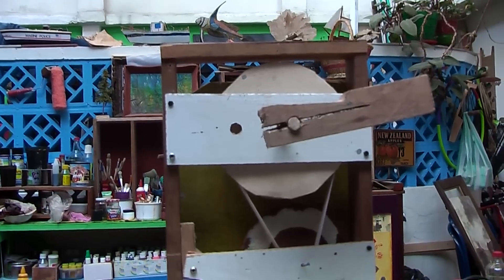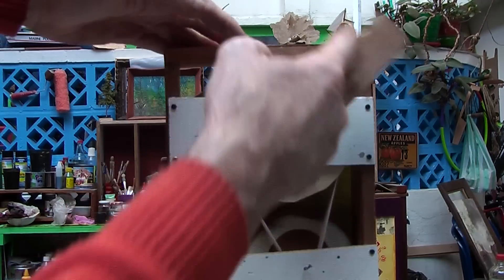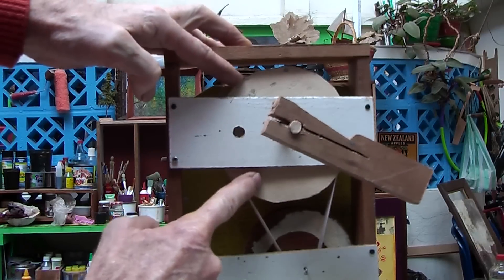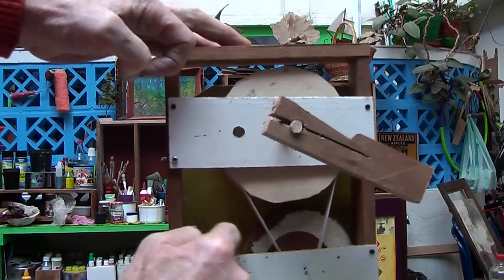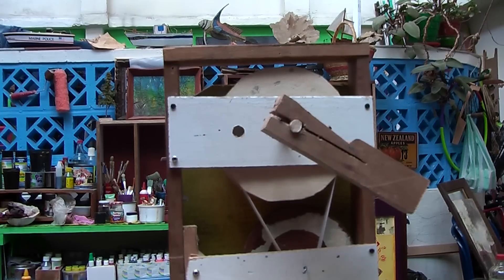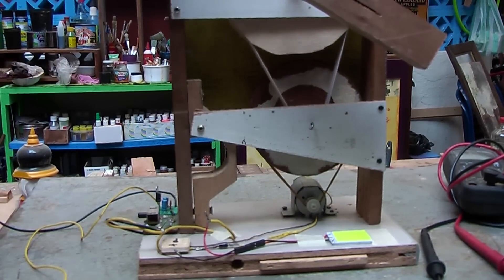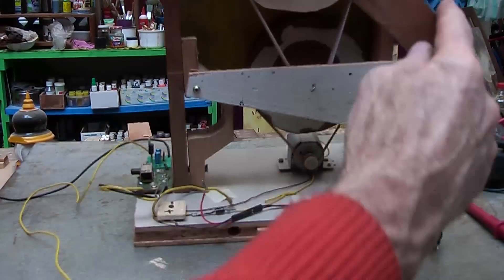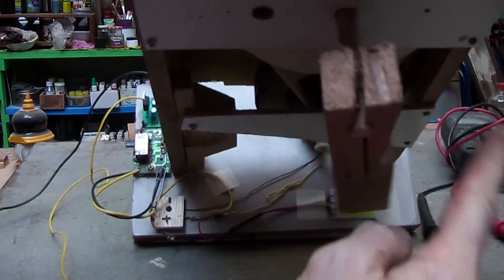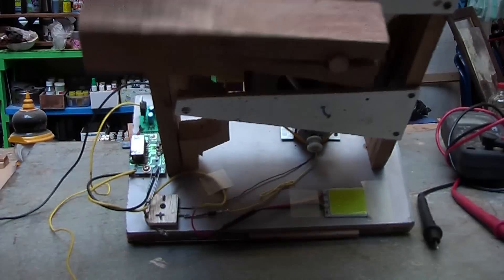Having proven the point, I decided to go a little bit simpler. Instead of using cogs, I just used pulleys — going from a first wooden pulley with cardboard sides, to a brass strap, to a wooden pulley, down to a motor scavenged from a printer. That generates 12 volts at 40 milliamps, which is enough to run a motorbike headlamp. It's not very bright in daylight, but it's quite decent at night.